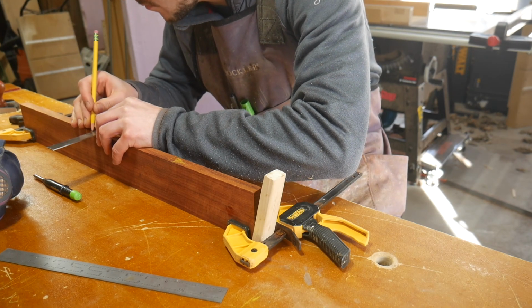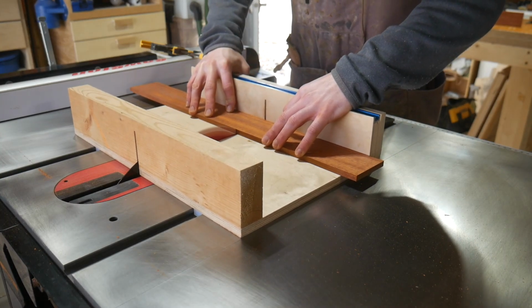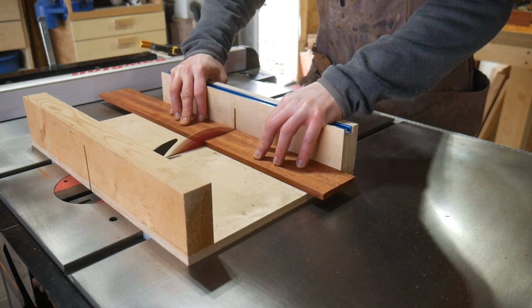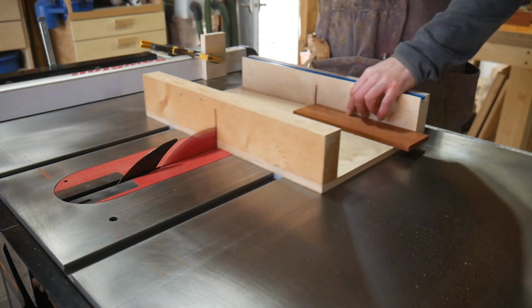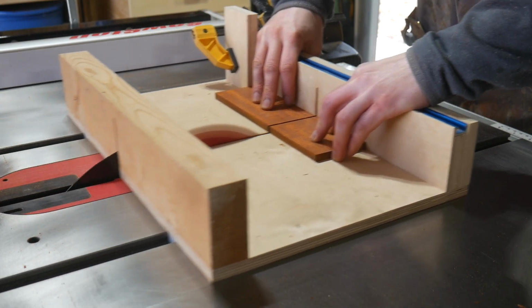Now I'll leave a link here to a little helpful page that reminds you how to cut the wood to do the continuous grain mitered edges, because it's not super intuitive. It takes a little bit of thinking, but once I've got that down, I label the pieces carefully and bring them to the crosscut sled to cut them to length.